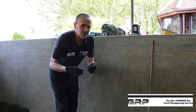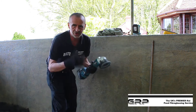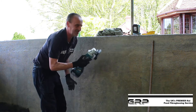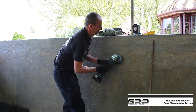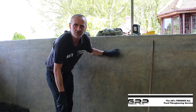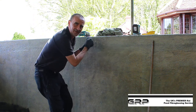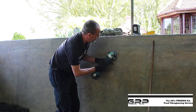Let's imagine the roller picked up a stone and it's sitting on the surface. Eye protection, skin protection — all that. If it won't rub out with the hand sander, then pretty tentatively kiss it down with the power tool. If you have done any damage or gone through your fiberglass because you were overzealous with the machine, just patch that off. If the stone is sitting on the surface you can work pretty accurately even with a tool like that and literally just close up, study it, and just kiss it down.